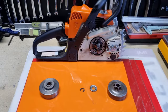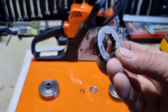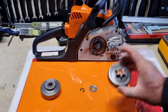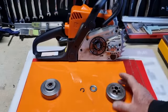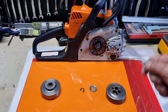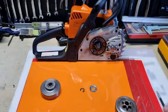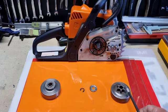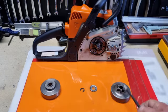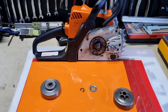So the advice is, while these spur sprockets are fantastic, they're about $8 aftermarket. These floating rim sprockets I get aftermarket for about $36 — and I'd hate to buy one from Stihl, they're probably about $70 or $80. Anyway, this saw is 17 years old and I've only had the floating rim on for about 2 years. I'm going back to the spur sprocket because it's much better torque using the smaller rim sprocket. The floating rim tends to bog down — not so much on smaller logs, but on logs 6 inches and above. So I'm going back to that, and if it wears out I'll just pay the extra to get one of these aftermarket. Anyway, thanks for watching. Bye for now.